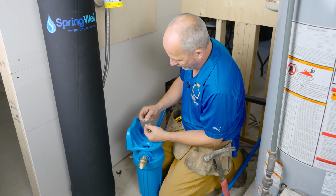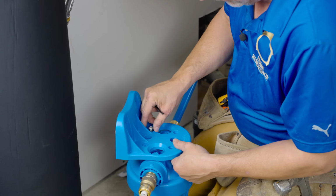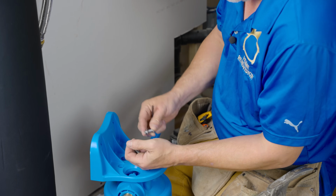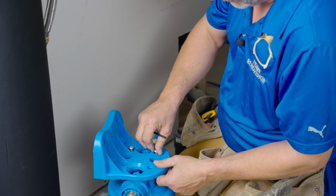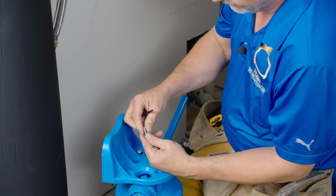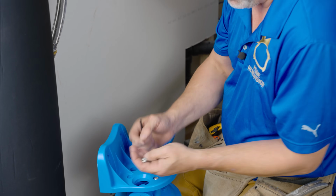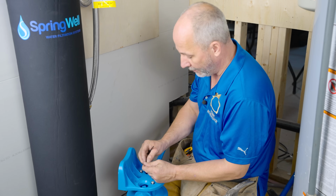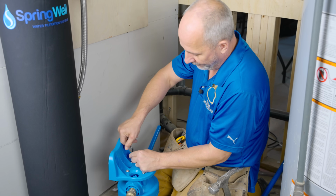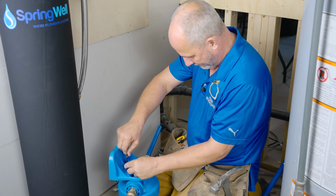All right, here we go. One washer, one machine thread screw. We're going to just gently finger tighten first before you use any mechanical tightener with machine screws. Make sure that you're not cross-threaded. Just get a few threads in. It's good practice whenever you're doing these things with machine threads. Once you start tightening, you reduce the capacity of the rest of the threads to line up really well. So now that all four of these are in here, we can just tighten them all and put a little torque to it.